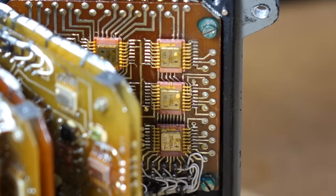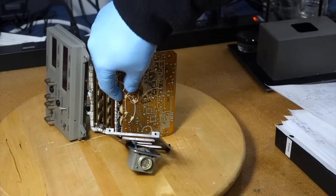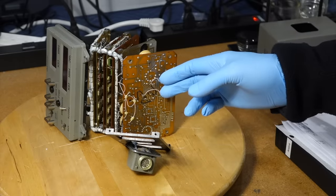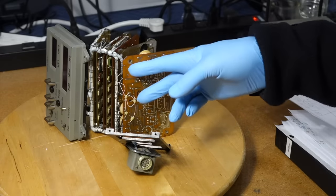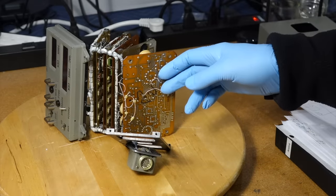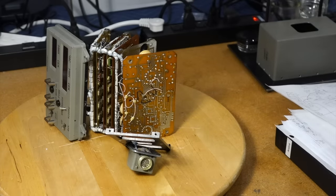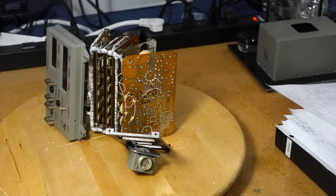Oh, okay. You can see there have been some wires added for external powering. These two wires were added to the 5-volt output for the chip. These two wires are wired right across the power transistor, which doesn't make any sense. My suspicion is that the previous wires powered up the chips, but the display didn't light up because the LED side of the power supply was not being powered, and then these wires were put in the wrong place, so it probably never got working. I hope they didn't zap the transistor, though. No, it should be okay. We'll figure out pretty soon. The transistor would normally have 24 volts across it, so putting 5 volts across it should be okay.